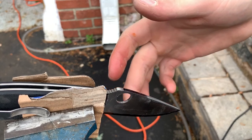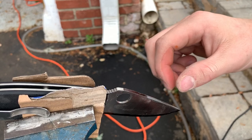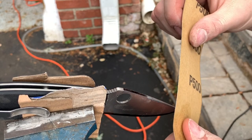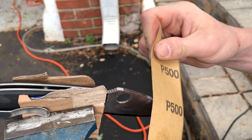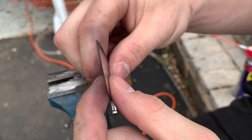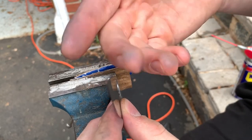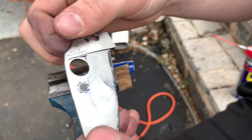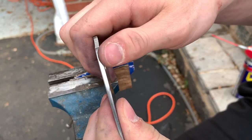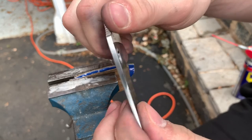Now you do want to be a little bit careful — this edge is still sharp. So you definitely want to be mindful of where your fingers are. If you want, you can actually tape up the edge. As you can see here, I have rounded the spine to my liking. It's kind of hard to show on camera, but it's nice and rounded right up here. You can see all the stuff that comes off, so I'm clearly removing material. And this edge right here is still at a 90 degree, which is what I want. But this side is just as rounded as this whole area, which is definitely nice.